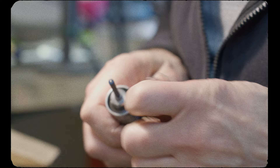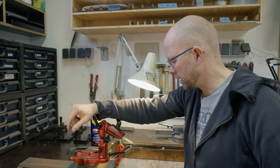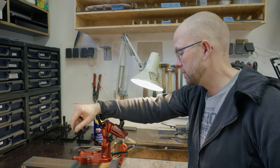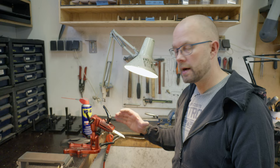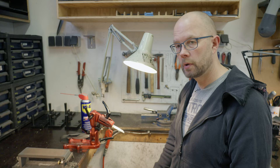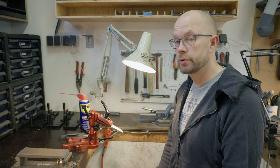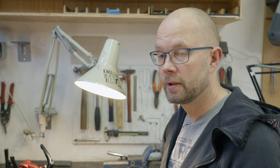The process I'm preparing for now is probably called hand satin finishing or hand rubbing — I just like the sound of hand satin better. It's a process where I use fine sandpaper and polish the flats. The end result I'm after is a very even finish where you will see the grind lines or polishing lines are very even, without any small scratches. There's no shortcut — you just have to practice. I've been practicing for 20 years. And trust the WD-40 — that's the knife maker's cologne.